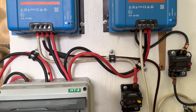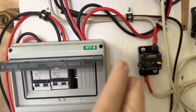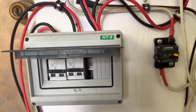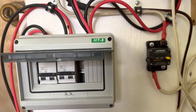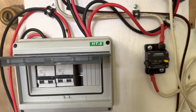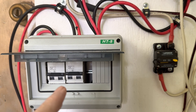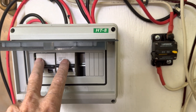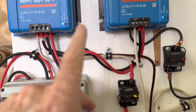The idea with the solar isolator switch is that a lot of times when I come in here and want to make an adjustment or change out a part, the first thing I want to do is shut those solar panels off without having to go outside and literally disconnect everything. Sticking on an isolator switch makes it much easier — I can just flip these down, or flip off just one string if I wanted to.